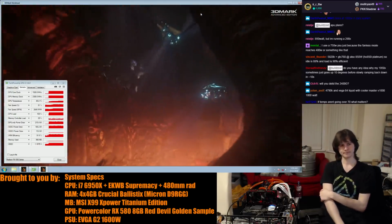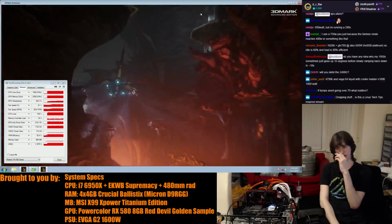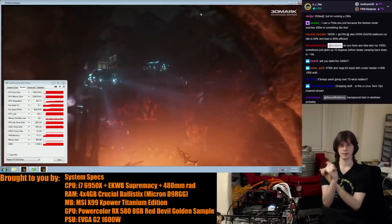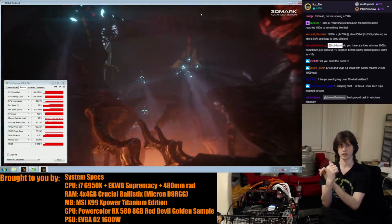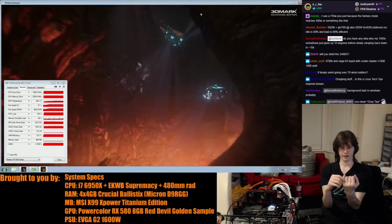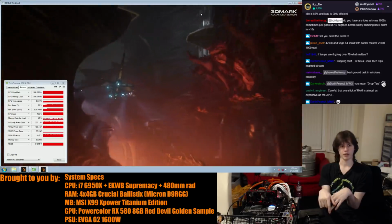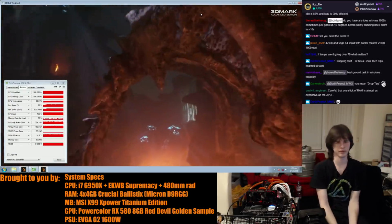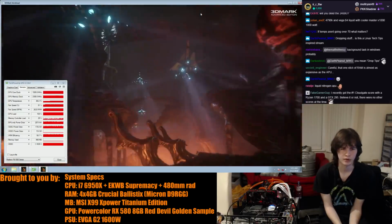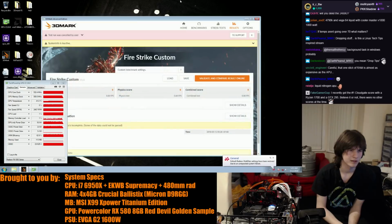And also, from what I've read on Facebook from Lucky Noob, the memory controller on the APUs seems to be a lot better in terms of behaving at low temperatures. I might actually run the APU on liquid nitrogen. I don't know yet. I might. It could be kind of interesting to see the little Vega iGPU doing 2 GHz. He posted that basically the APU memory controller is really similar in behavior to the Ryzen 2000 memory controller. So I'm hoping that it'll actually clock pretty high memory clock. It might do like 3800 at CL12, which would be pretty cool. Or even like, and that crash. Okay, I'm going to say that's not, I think that was the core.